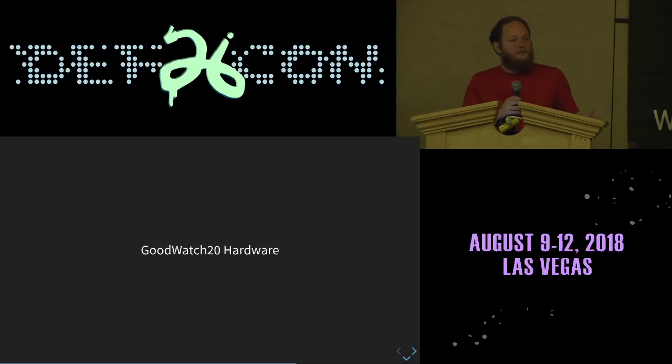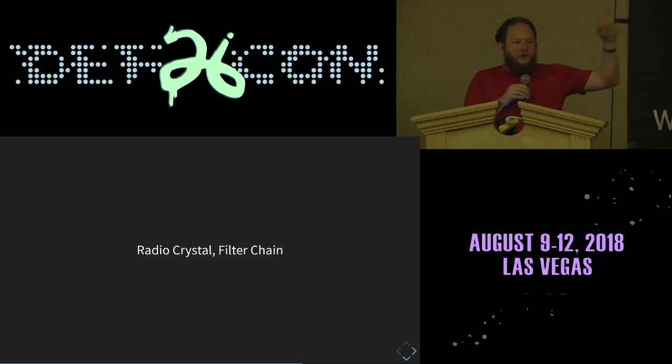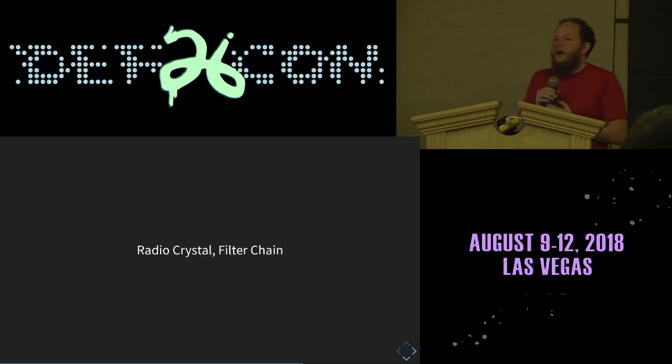Then we need a radio, because there's no point in having a fancy watch with a disassembler if it doesn't also give you a really cool tool on the side. To add a radio to the non-radio version, I needed to add a crystal. It's a 26 megahertz crystal that provides the timing needed for the phase lock loops and the other analog pieces of the radio. And I also needed a filter chain.